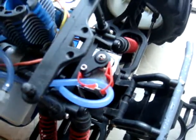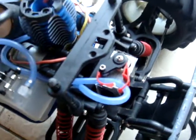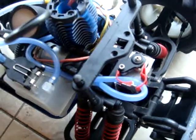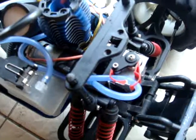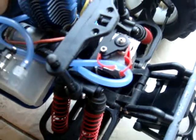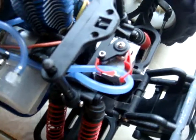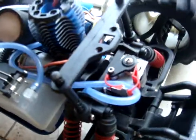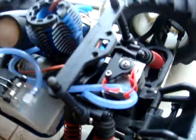And of course, it doesn't create a problem for the forward or reverse system in any shape or form, because you've already brought the vehicle to a stop. By pushing that button, it just goes into neutral, and now we're blocking the fuel line and stopping it. And of course you can't start the vehicle again until you push that button, and do it now, and then it opens up the fuel line, then you can restart it. And so it's a very simple system.